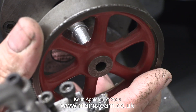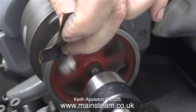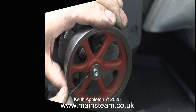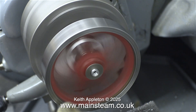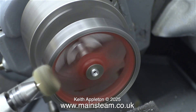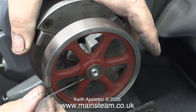Here's a flashback to the flywheel before I machined away the chilled part, and as you can clearly see from this image it really didn't look very good to start with. I thought I'd treat the front face to a bit of wet-or-dry sandpaper to give it a really good finish. All traces of any chatter marks have now gone. It's okay having one side of the flywheel nice and shiny, but what about the other side? Here I'm turning it round on the mandrel and using wet-or-dry sandpaper one more time to clean up the other side. This proves stubborn because there were some rust marks on there, so I used the Proxxon motor tool with one of these rotary abrasive things, and after a while it was starting to look better, but I still had to apply some more wet-or-dry sandpaper to make it shine.